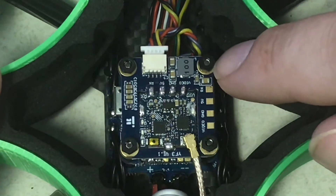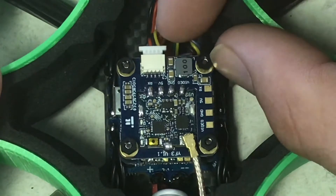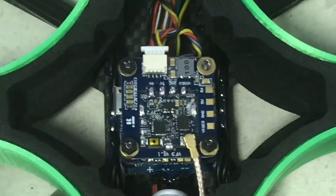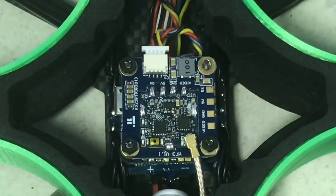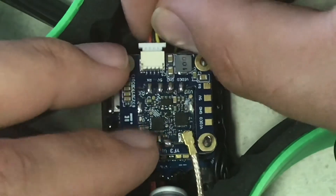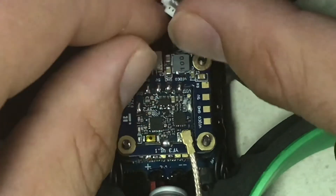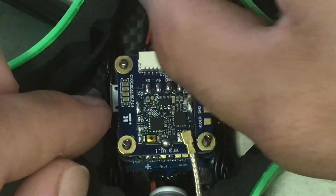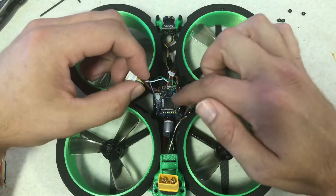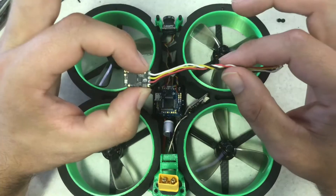What we have to do is unscrew all these screws. These screws are actually really really tiny — you might be able to get them with your fingers. I was able to do it with a pair of needle nose pliers, so be very careful. Now that we've got these screws off, go ahead and gently pull this connector right out — it goes to the board below it. This is where everything gets connected for your radio controller.